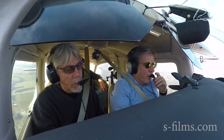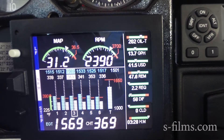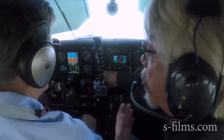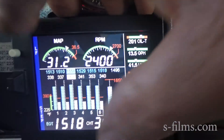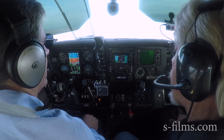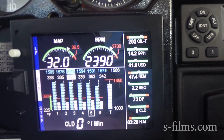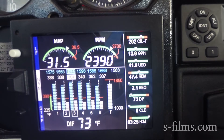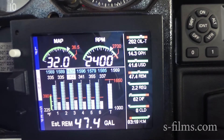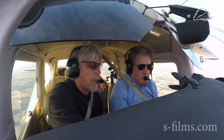Near the airport, we're going to do our in-flight mag check. We've normalized on the EDM. Pulling it out one more time — if you're in cruise flight and traveling, after a while you'll see the bars start to stagger and wander a little bit on their own. Just take it back out, come back in, and calibrate it again. Back to normalize for the in-flight mag check. Two clicks to the left: one, two — there they come up, a nice rapid rise. We get the alarm, which is good. Going one click left mag. You don't need to hold it quite so long — it's hard on the temperature. On a lot of T210s, you'll see the TIT come up if you hold it too long.